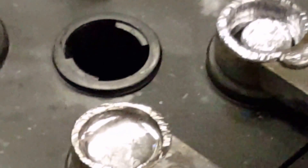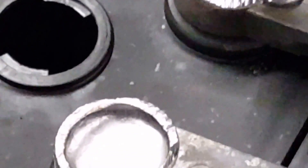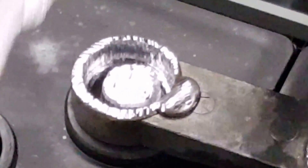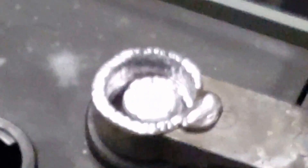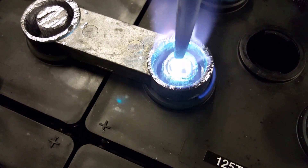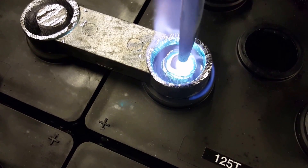What I mean by connect — you're actually melting the center of the intercell connector, and then melting the side of the intercell connector, and those two melted pieces of lead actually join together. This is a little bit closer version of what this connection process looks like.